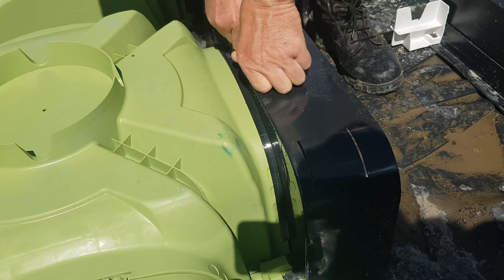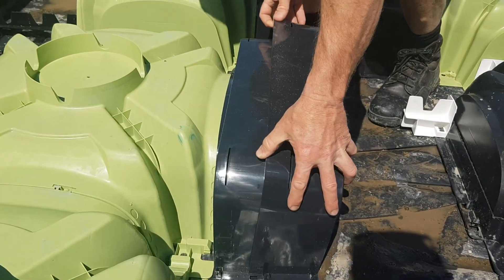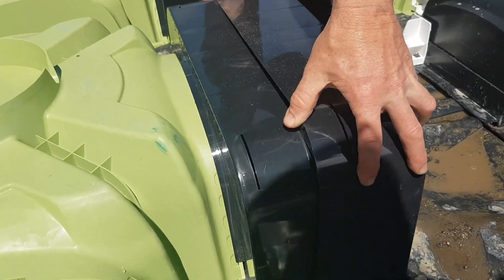The Cupod extender clips to the side of the Cupod, which creates a void filler up to 500mm at 100mm increments. The added benefits over the old Cupod extension include increased volume — which means less concrete required — a fast and stable installation, and a built-in end cap, reducing the amount of customised assembly on site.